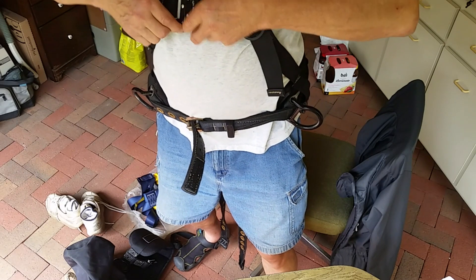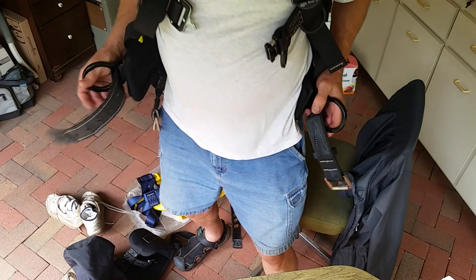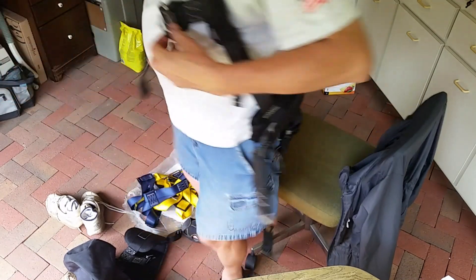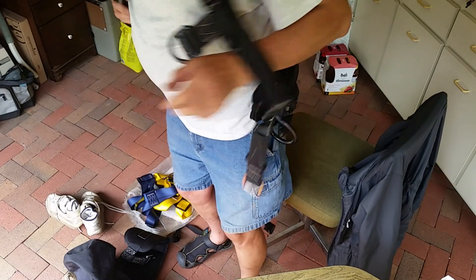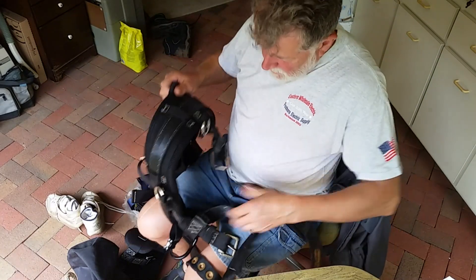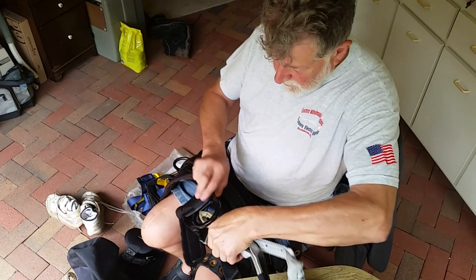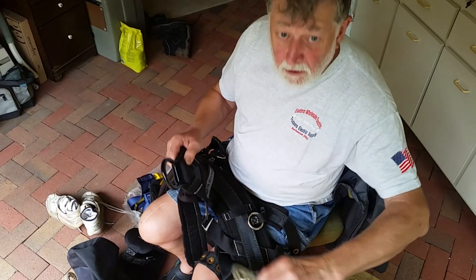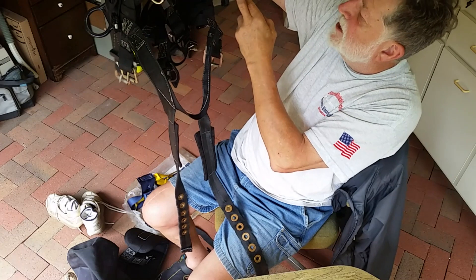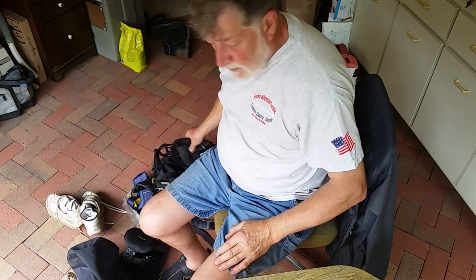You can combine quick releases and regular buckles, or a mixture. There are places to hook lanyards to hold you to the tower. I have a ring on the back and a ring on the front. The ring on the back is typically where you put the fall arrest because it keeps you away from the tower and minimizes how much damage it can do to you. Most of these are double-lock — it takes two actions to open and close them. There are also small places to hang accessories and extra carabiners.